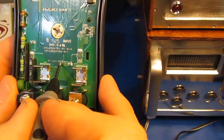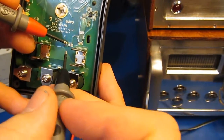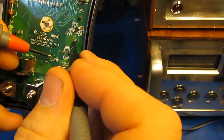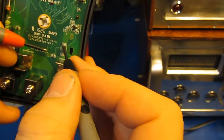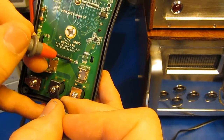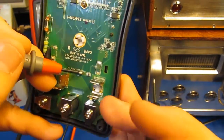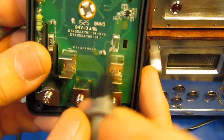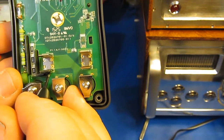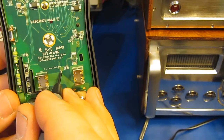These have a maximum breakdown voltage of 29.5 volts and a maximum clamping voltage of 38.9 volts. Getting back to this trace over here, if we look right next to that, you can see these four vias and this small inductor. These basically go back to this side of the current sense, which unfortunately is ground. So if we see between the common, this is all attached here, and we can see how close this area is. I think what's going to happen is if I discharge this again at the higher voltage with this insert, there's a good possibility it would break down between here and here.